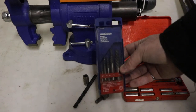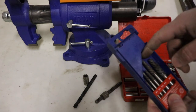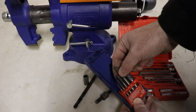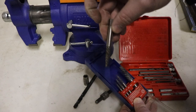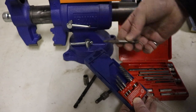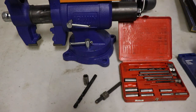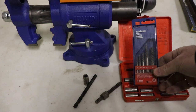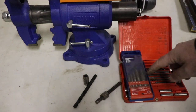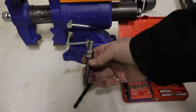If you have a conical type broken bolt remover, you just have to eyeball it and drill in and hope that it catches. It's just going to catch on a small part of that bit — not going to be a good bite necessarily. I find you put a lot of pressure on these and they don't fit in the hole always and can't reach in very far. Whereas these have great depth reach.